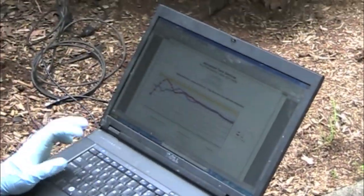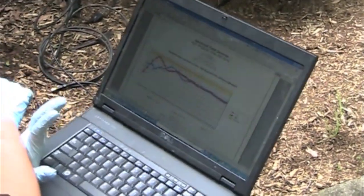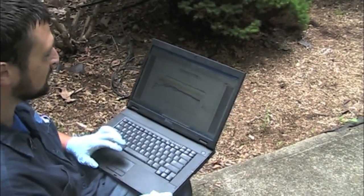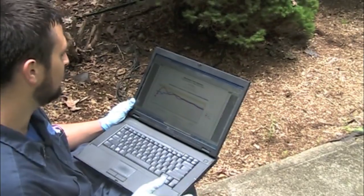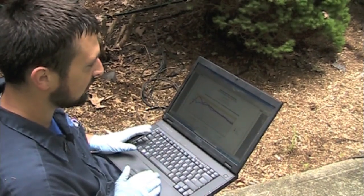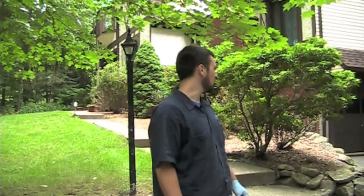Done with the test — this tank passed nicely. The microphone in the tank gives us a whole bunch of data and the computer makes a graph out of it. This is all the information from the tank test and it shows that it passes — this is what we'll give to the client. We have a passing tank. It actually passed on all three parts of the test. Normally we only need at least two, which would be the soil and the vacuum test, but we passed all three here. So we're just going to pack everything up, let the customer know the good news, and onto the next one.